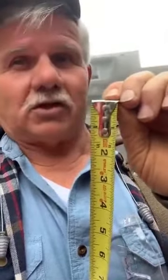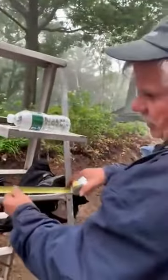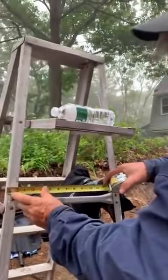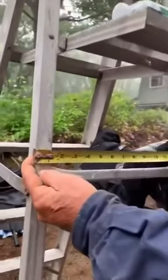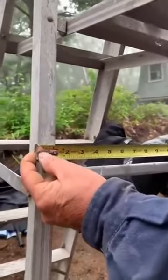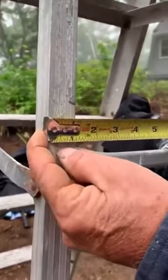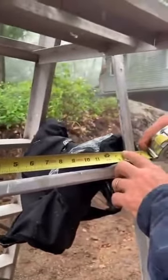You know why I want it to slide? Because if I'm taking a tape measure and I hook it on something, let's say I hook it right here and I want to get the measurement from point A to point B, I hook it on, watch, this will slide just a little. You see that? Watch it again. It'll slide. See it move? See how my rivets, right there, are moving? So now when I take it across here, I have the measurement here of 14 and an 8.